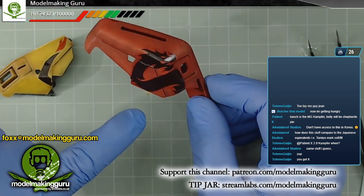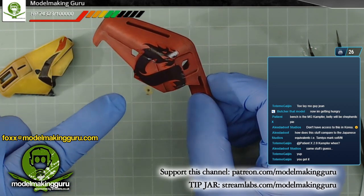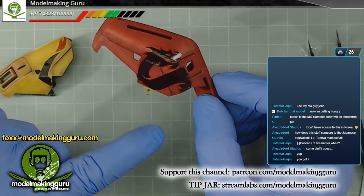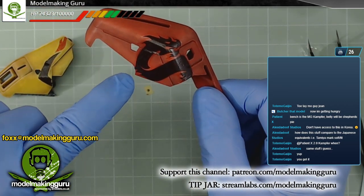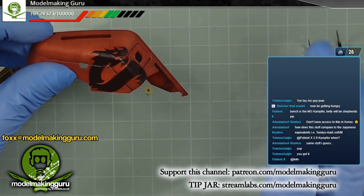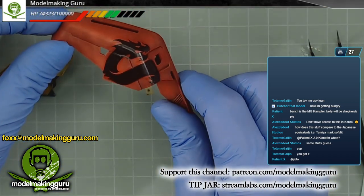Just there, like a sort of teenager's bad day. They will eventually go away. They're either little air bubbles or it could be stuff on the surface of the paint, little bits of dust or even just the texture of the paint. They will hopefully go away eventually. If not, I can always squidge them down a bit. And if any of those are air bubbles, if you've done a few coats and you've let it all dry and it's still there, prick it with a pin and then give it one more coat and it will pop the air bubble and let it settle down. So we'll keep an eye on those.